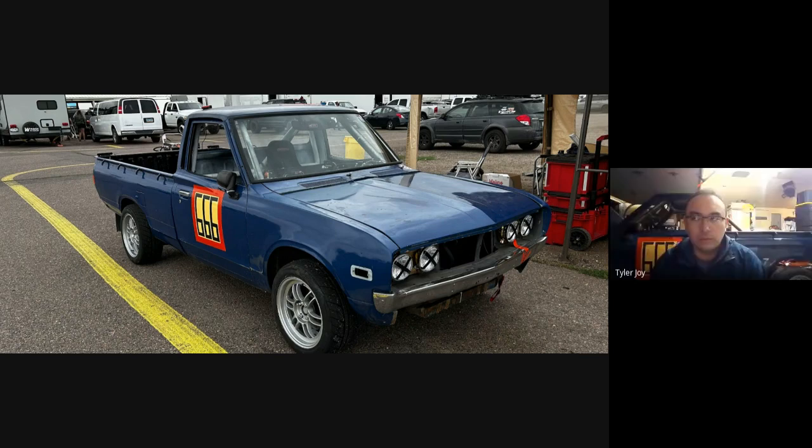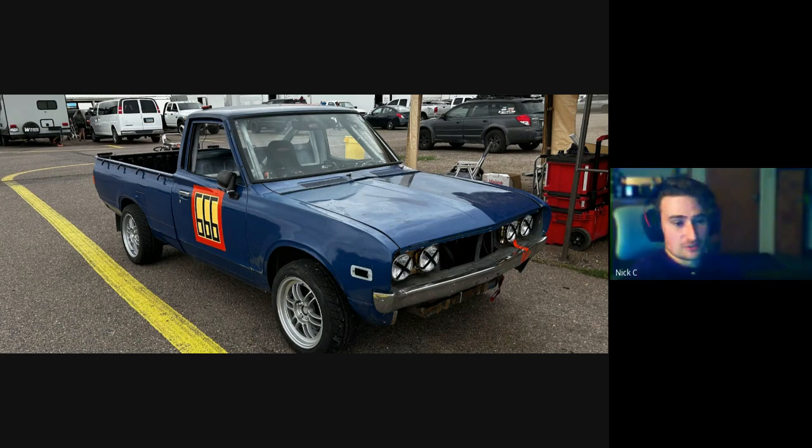Yeah. So everything gear ratio wise would be in the diff. Right now we're running a 3.9 Torsen, like a Miata diff. You can run, I think it's an RX-8, 5.3 to 1. That's probably going to put us over speed on the Hyper 9 at top speed. We'll probably be doing like 9 or 10,000 RPM. But right now we're topping out at about 86 miles an hour. We're not even getting close to 8,000 RPM, which is the rated maximum for these motors. So we're just not getting enough torque at the top end. And we're ideally drag limited there too, so increasing aero efficiency should hopefully help bump that up a bit too.